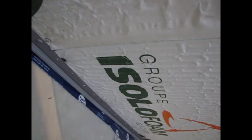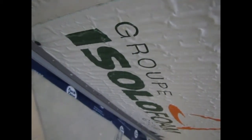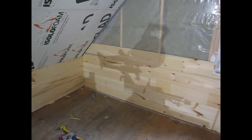Well, I just took a piece of drywall. This is like an end stop for drywall, right? And there is a rafter up here nailed into that, and this goes right up against the stud there. So when I nail these pieces in, it has to stop right all the way along. You see where my hand is. It stops the board from going in. I have to do this wall first, the end wall, and then the ceiling boards will butt into that. I'm going to try and back up here without tripping, so you can see how. So that's the end wall, and it's done with the metal all the way up. I'm not focusing. Anyways, on that side also.